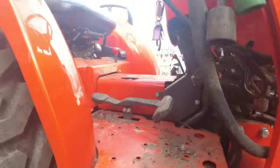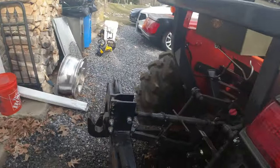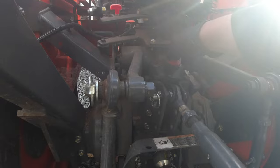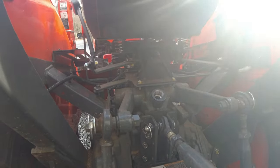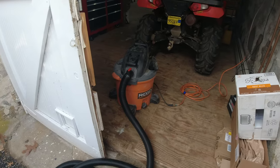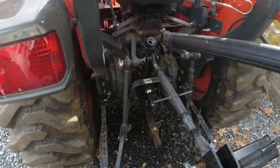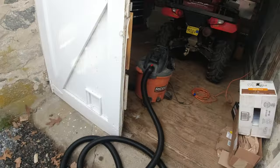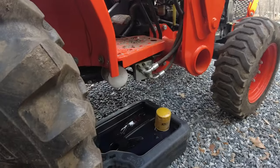Next we're going to do the main hydraulic filter, which is right here on the right side of the tractor underneath the floorboard. I'm going to show you a little trick — you can lose quite a bit of fluid coming out of that one. So if you come back here to the oil fill and pop the cap, by taking your standard run-of-the-mill shop vac, it just so happens that the hose fits right over that actually pretty snug. So if you put that on there and turn on the shop vac, it creates some suction while you're swapping out the filter and you don't lose quite as much fluid.